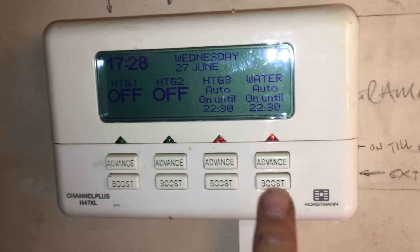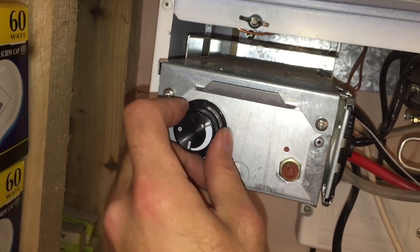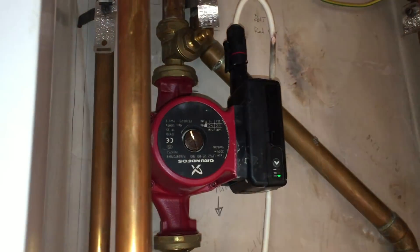Give it demand. This is how we test it — it's on now, power's on. The boiler stat's still on zero — we turn that on and the boiler should run. It's starting to try. Pump's obviously running.